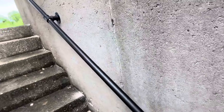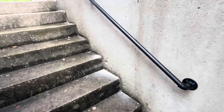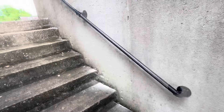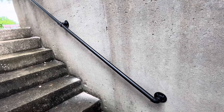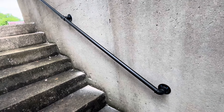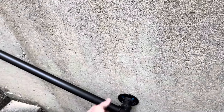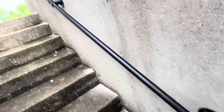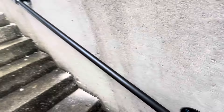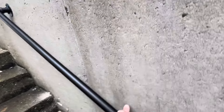All right, the handrail is installed. Now I need to clean these steps — they make the new handrail look bad. I would recommend this product. I was a little apprehensive when I bought it thinking, how do you get all of these plates to line up? The way you do it — like this elbow — you just position it so it lines up with the other two. It might be a little loose when you do that, but when you tighten everything down and fasten it against the wall, everything is tight.